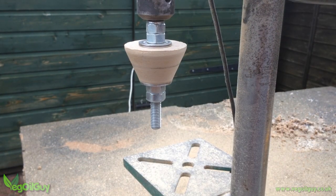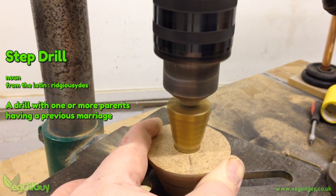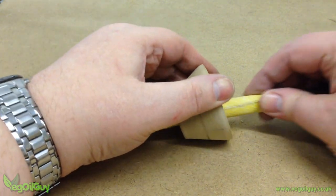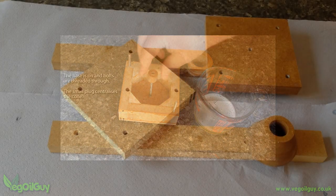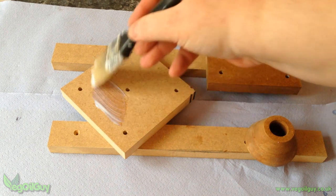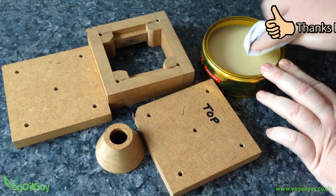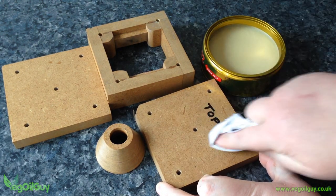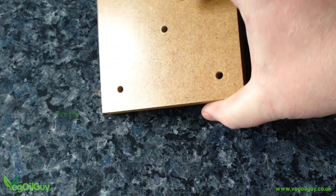After a bit of sanding it's a nice fit and it's good to go. To hollow out the inside of the cone I used a normal step drill. This does require a firm grip so be careful, but otherwise just take your time and let the drill bit do its work. The drill bit leaves ridges, but these can be removed with a round bar and some sandpaper. Last time I used water to stop the silicone sticking, but this caused the MDF to swell, so this time everything will be finely sanded and three coats of fast drying varnish are applied with a fine sanding between each coat to remove any brush marks. Ron, one of my subscribers, recommended using car or furniture wax as a mould release agent, so every surface has been given several coats of car polish, except the insides where I need the silicone to stick. Everything is slick, shiny and slippery. This layer of wax will further help seal the MDF and prevent moisture problems.